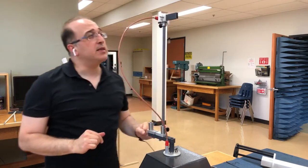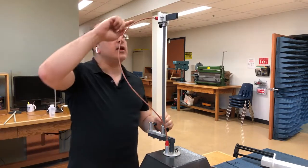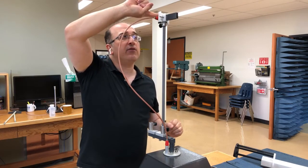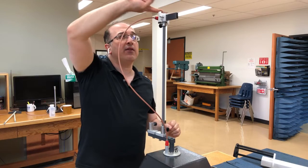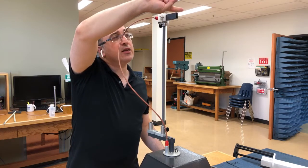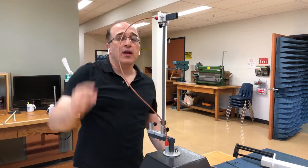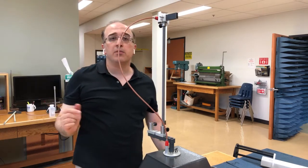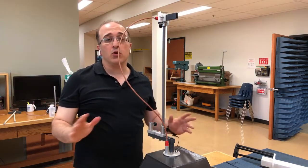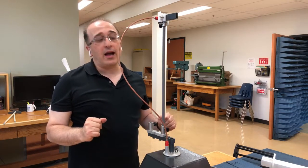Our system is now ready. If you look at the SMA cable, it goes into the waveguide and the electric field inside the waveguide will have horizontal polarization. When this radiates, you'll have horizontal polarization. We've set up the transmit antenna also in horizontal mode, so they are matched to each other.